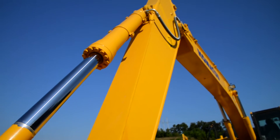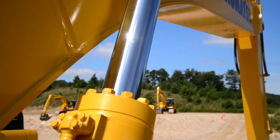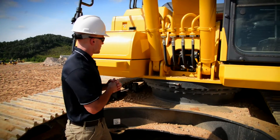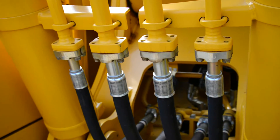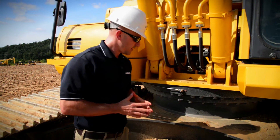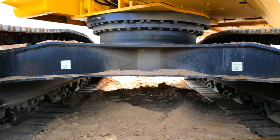From here you can step back and start your visual inspection of the arm and the boom. Work your way up, looking at your lines, your hydraulic cylinders, and also all the welds, which will bring you all the way back to the machine where you come to your boom cylinders. Check for lubrication, make sure it looks alright. Take a look at your pipes and your hydraulic lines. Take a peek at your top hat and your swing circle, and then step back and take a look under the machine to see if you notice any leaks.